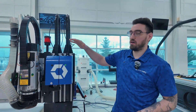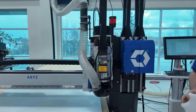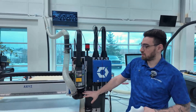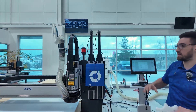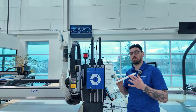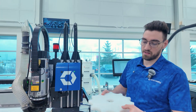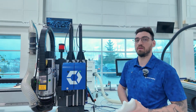We're ready to cut here on our Trident, but we can cut this on any one of our platforms. A couple of key features to point out when processing industrial plastic specifically: right here on our side we have our Vortex cold gun, which is basically shooting a cold stream of air on our bit — it helps prevent melting and re-welding, keeps our bits in good condition. We're also using our high-capacity pressure foot, getting a really good seal. Combined with our iVision system, our 4.8 model, we're going to get really good chip collection, making sure we're getting all that material out of there, keeping the bits cool, and maintaining a really good finish. You're going to want to use O-flute tooling for this because we want those chips up and out of there — that's going to give us a really nice finish. We're going to be cutting at about 200 inches a minute, and we're going to do all of our profiling work, holes, and pockets with the same bit, keeping it as quick as possible.